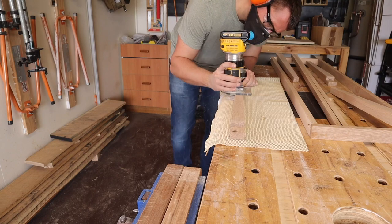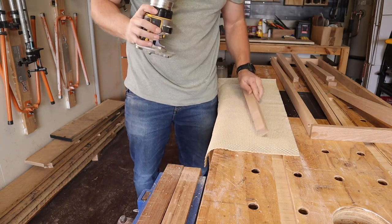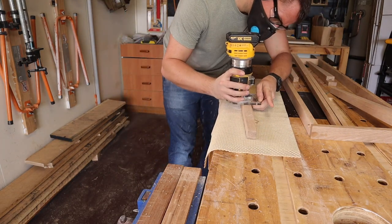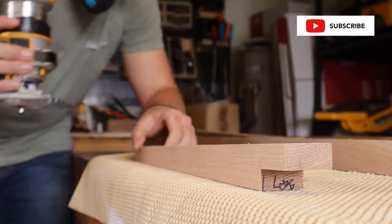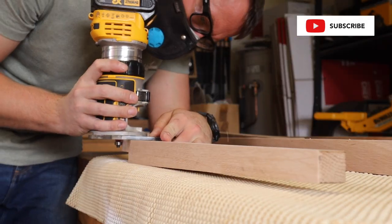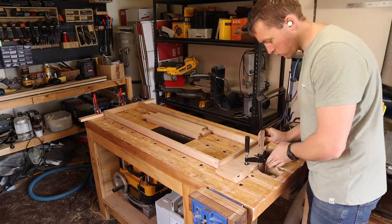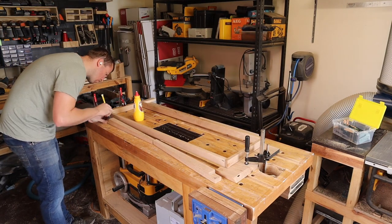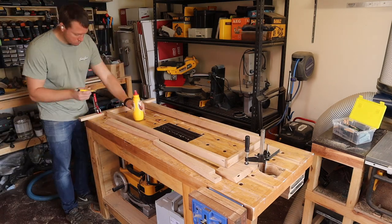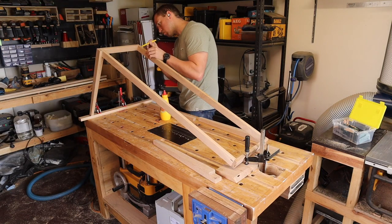Time for many a round over, which I actually find really satisfying. To make sure my legs are all square when I glue them up, I've clamped some scraps to the bench that the legs will be flushed to once all glued up. It makes life easy when you can just clip a leg in and move to the next one without worrying about it moving.